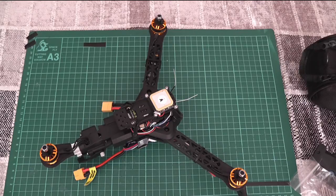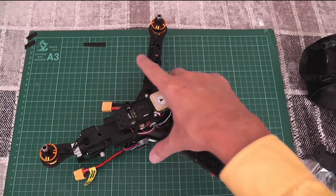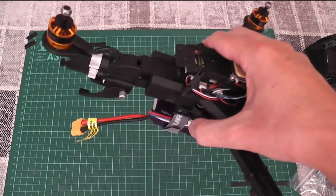A couple of days ago I went to fly it again and attempted another auto tune. It went up in the air and did fairly violent tilts, then slightly less violent tilts, all the while rotating around me with the tail pointed towards me. After it got to about seven o'clock it suddenly spun quite violently in the air — the same as it was doing when the servo was reversed. I don't know what's happening there, but I think the servo has given up the ghost. Maybe one of the crashes has damaged the servo and this last flight has broken some cogs or something has gone wrong. So I need to inspect that.